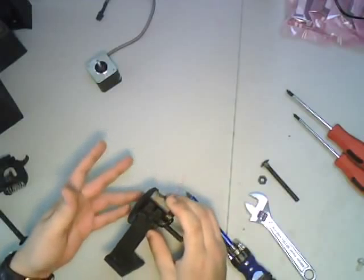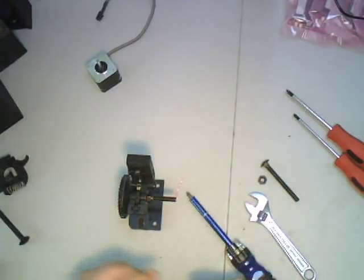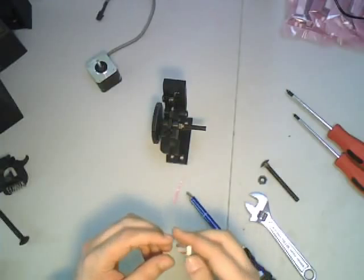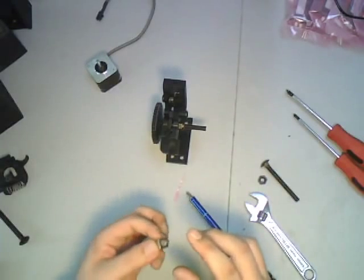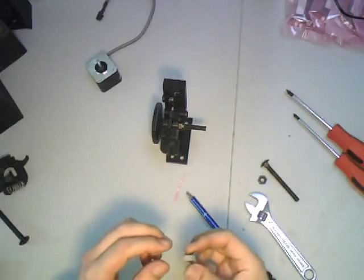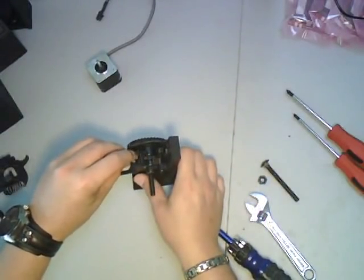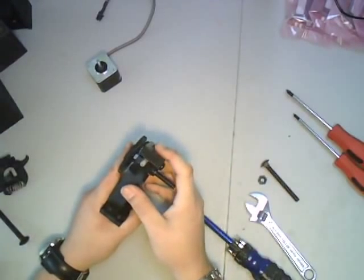People have asked how we capture the Bowden tube at both ends. On this end, what we do is we've threaded a section of Bowden tube — this is just a scrap piece, but enough to show the process. We tap or thread the end of the Bowden tube for about an inch, then screw that on the filament feed drive end onto a square nut. You don't have to tighten it all the way — you actually want it to be able to rotate a bit because of the way the machine head moves. That square nut is press fit into the top of the filament feed drive, and when this arm closes it holds it in place.